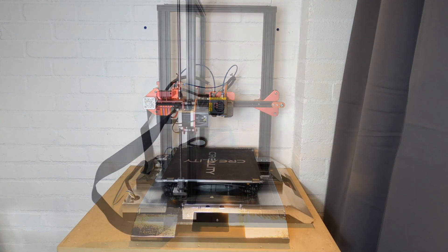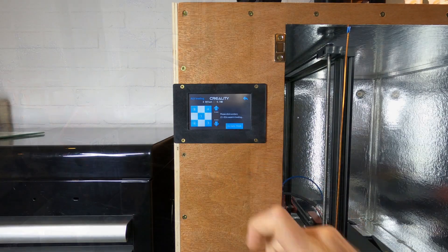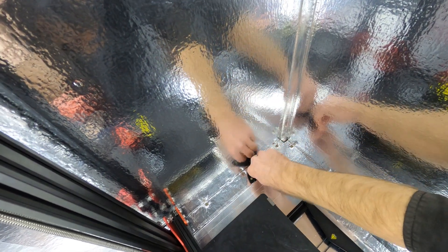The other thing I've done in this enclosure, which I haven't seen other people do with this printer, is to turn everything through 90 degrees. I didn't have enough space to have the printer sticking out from the wall 700mm or so, so I tried turning the printer through 90 degrees so that you access everything from the side. I've been using this enclosure for about six months now and wanted to give it a really good test before recommending anyone else build it — and actually I got used to it straight away. The only time you have to be mindful of the printer being sideways is during bed levelling — your front right is now your right rear. Everything has come off the bed easily, and having the printer this way around makes loading the filament even easier. I've also allowed access to the SD card with a 3D printed finger guard piece, and in future I plan on adding remote connection to my printer so I won't even need the SD card.